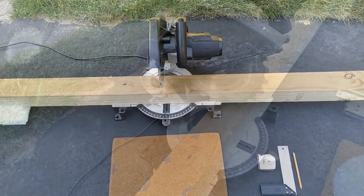You may have to rotate these posts because since it's treated wood, they're pretty well known for warping. I had to rotate them end for end and side to side to get the best fit. Then we just lay them over and put a little bit of the Liquid Nails on. Just to help keep these secure, you want to zigzag your bead like that instead of going straight — you'll get a little better adhesion and it makes a stronger bond.